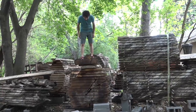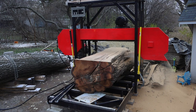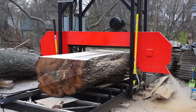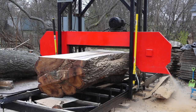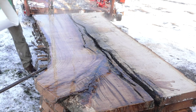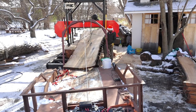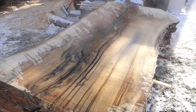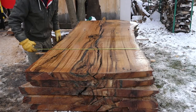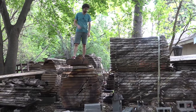Over here I have a red oak log that is four feet in diameter and about eight feet long, cut back in November. It had some really cool odd splits — half the log clear, the other half interesting. Both slabs are currently sitting at about 30% moisture content after about six months out here. Red oak takes a lot longer to dry than something like silver maple, so these will probably need about 18 months out here to get down to around 15%.